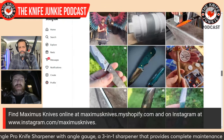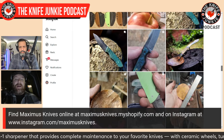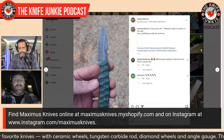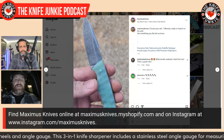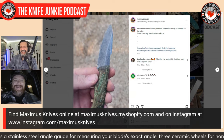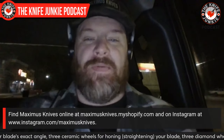Something I like to do is mix materials. My personal carry Mamba had what I call a laminated scale set — I'll take a synthetic like burlap micarta or G10 and get a real thin, like paper-thin piece of wood and do a laminate over it, like you would a guitar top. I'll take a burl wood and mix and match those up. You can see one — the blue one with black all around it — that's a blue-dyed bird's eye maple with black G10 on the back. When you grind all around the edges to do the 45s, it gives you that layered look. Someone told me if I'd put a red stripe on it, it would have looked like a Marine Corps dress uniform.